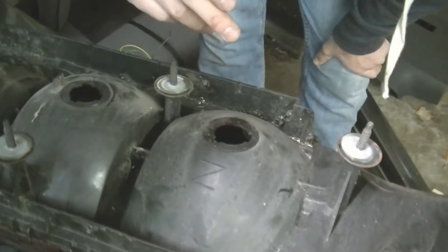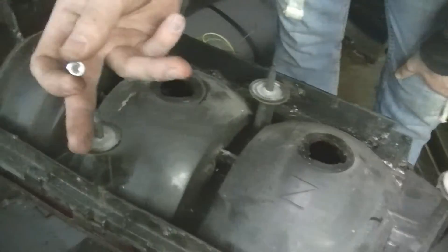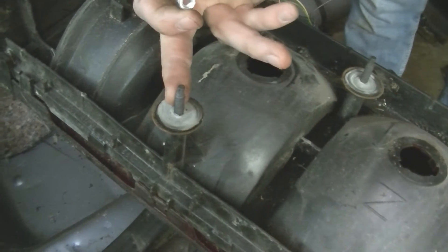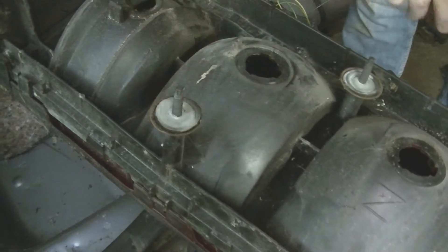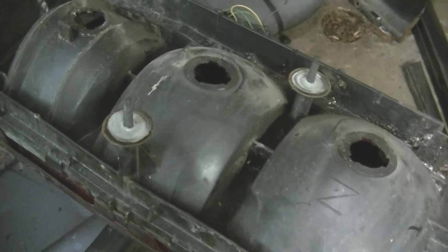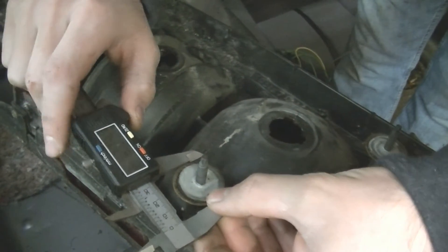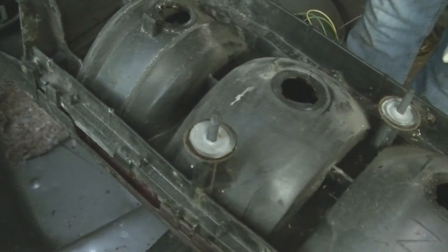So, we know what we want. I don't think I'm gonna put the threads in the 3D print — I think I'm just gonna let it go on. We're gonna make it minor diameter internal 0.215, and then it should just press right on. And the diameter out here, make it 1.25 inches, and then we'll have a 3/4 nut on top so we can twist it on.